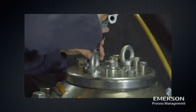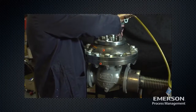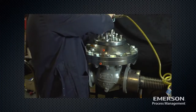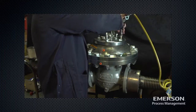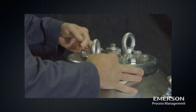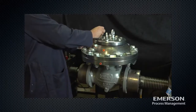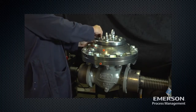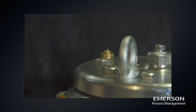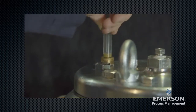Rotate the cap such that the outer holes for sensing lines are in line with the upper casing holes for sensing lines. To validate the alignment and before attaching the cap, check that the travel indicator is aligned on the cap and on the upper actuator casing. Mount the O-ring in the space between the cap and the upper actuator casing. Replace the travel indicator assembly.